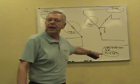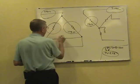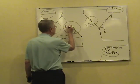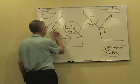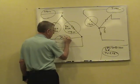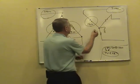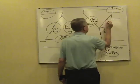Okay, we bought a 90 kVA transformer. Here's what we've actually got. We got three 30 kVA transformers. Each winding on a three-phase transformer is one-third of that total capacity. Kind of important to remember that. And assuming 100% efficient now, we got 30 available per phase on the secondary side.